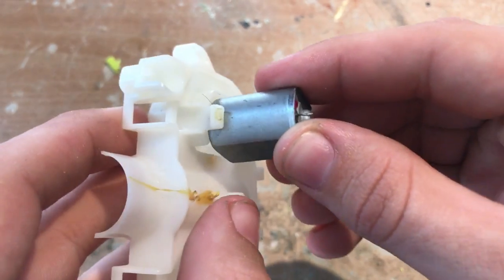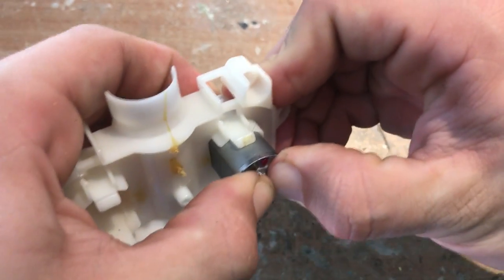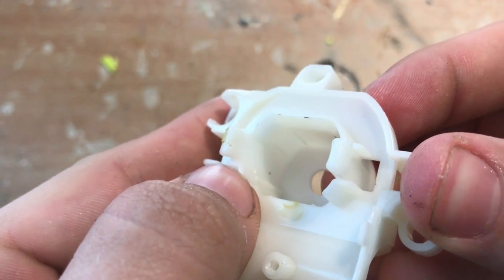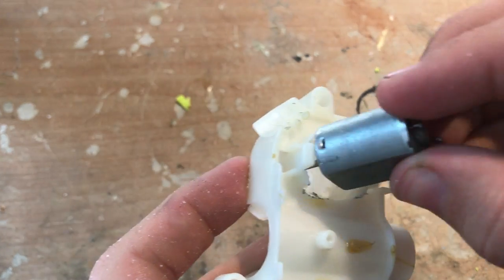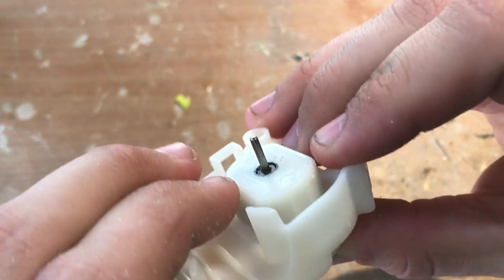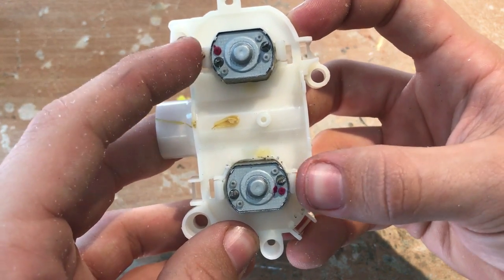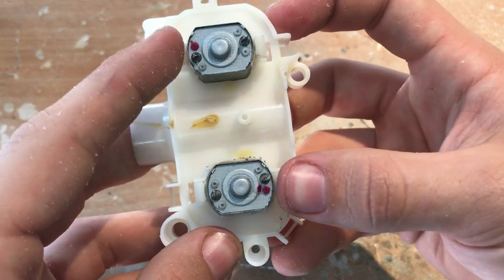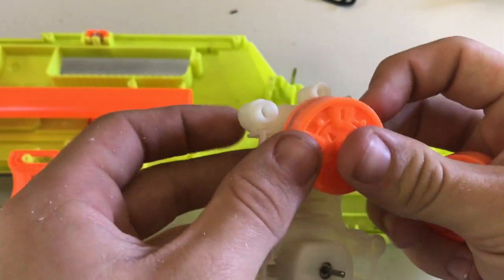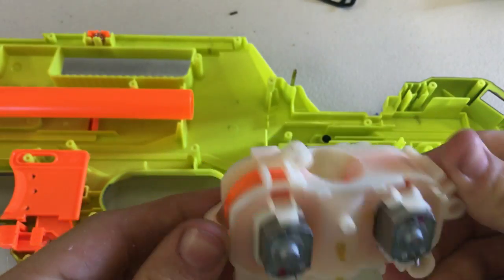Let's work on our motor cage. Our new motors are a little bigger than stock motors. Start by grinding away the nubs inside the casing, then flare out the motor shaft hole. Check your fitting with your motors. Once big enough, slide your motors in, making sure the two red dots are at the same position as mine. I have a very in-depth motor guide on my channel — check the card to watch the video. Now re-assemble your cage with your wheels, cage shell, and rubber retaining bands.